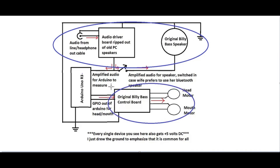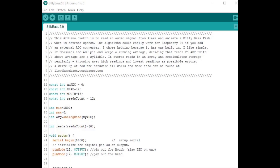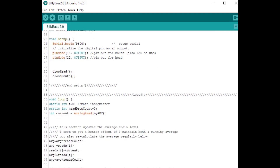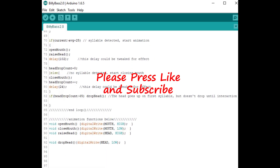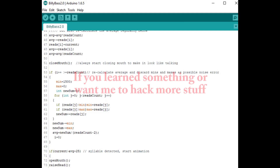With all of the audio stuff, the original Billy Bass control board, head and motor were already taken care of — it was time to mount our Arduino. I really did just wire directly from Arduino pins 12 and 13 to the original Billy Bass control board on the pins I pointed out earlier on the microcontroller. It would be prudent to add resistors in these lines, but when I measured on my board I was only pulling a few milliamps, which told me it was perfectly safe for the Arduino to source. With all the pieces wired up it was time to start testing code. I'll post a link in the description, and you'll find more information about my algorithm on my WordPress site. This code is written in sketch for Arduino, which is very close to C, but I tried to comment it well enough that if you prefer another language you should be able to convert it.